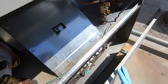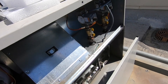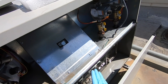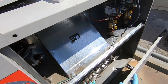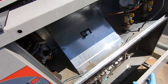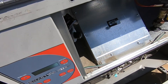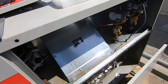Alright, we're gonna go ahead and put our cover back on for our pressure chamber - all zip tied, looking nice and pretty. For guys who never really worked on boilers, here's one thing: when you're taking panels off, this right here is a seal - see how it goes all the way around. This is really important. If this breaks or it's missing, you're gonna have air leaking out of here. This chamber can't hold the pressure, your pressure switch is gonna open, and that is gonna be an issue because that will delay your sequence and lock out your boiler. So you need to check and make sure your gaskets are good, otherwise you're gonna have air leaking out and that is no bueno.